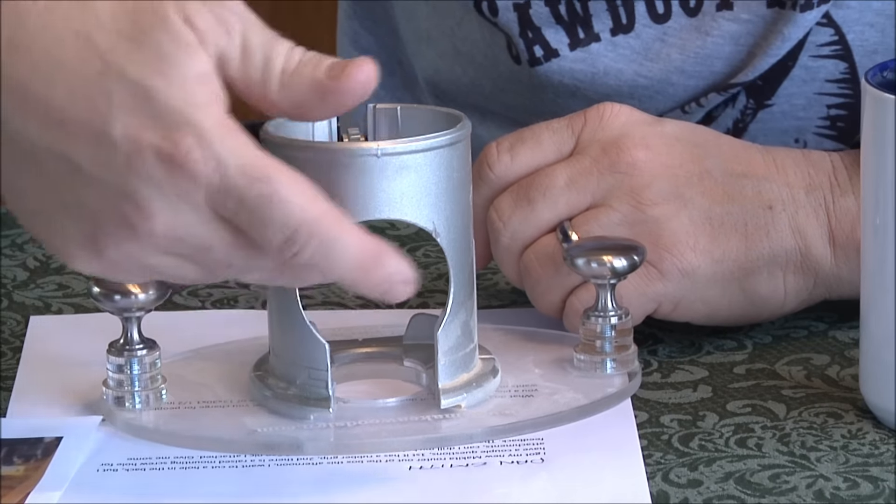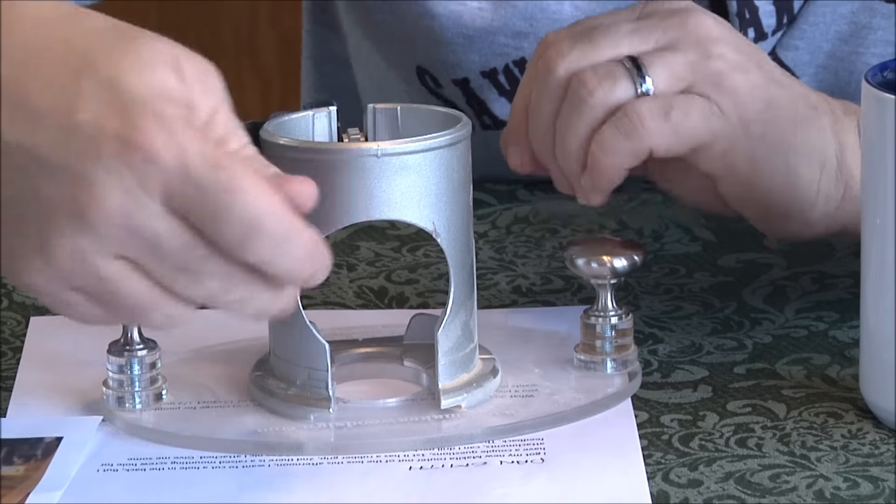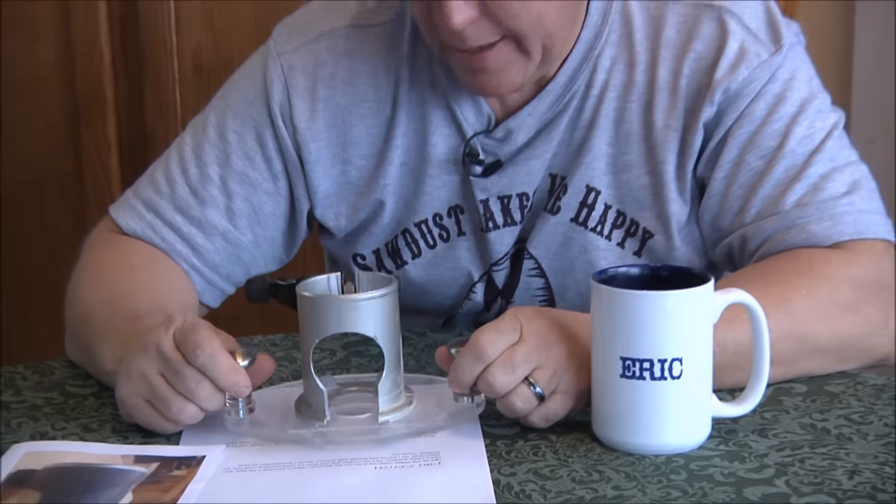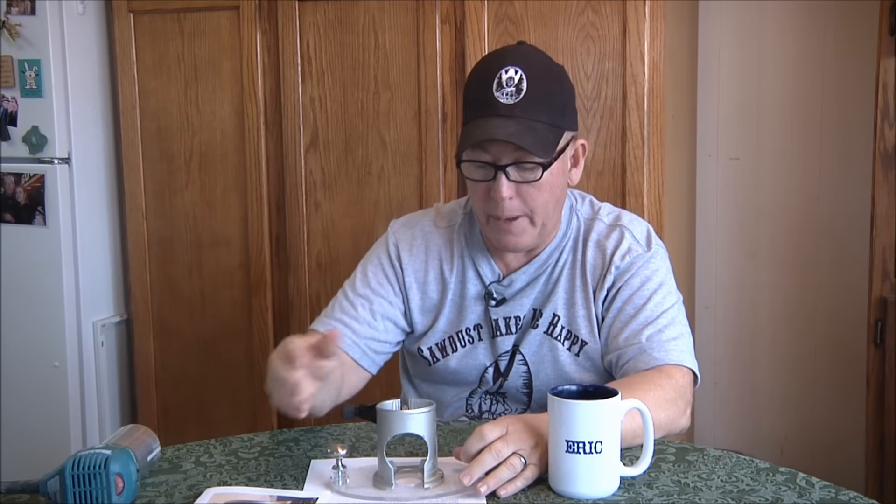I just cut that thing completely out. I took the rubber pad off, drilled my two-inch hole, dropped it down about an inch from the top, then I hacksawed that off and put my base plate on it. There may be some of you that did it differently or think that weakens the router base housing — I don't think it does. Anyway, that's how I modified the little Makita RT0701C palm router.